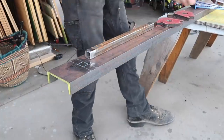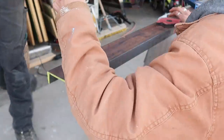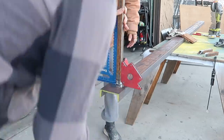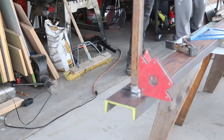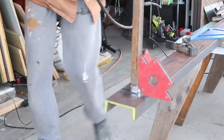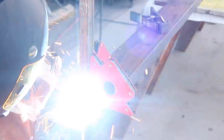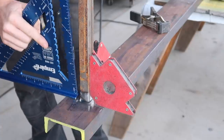With the angle grinder, I got a lot of comments about how people are also scared of it. And what I just want to say is pay attention to the sparks. I think that's the scariest thing, is you just need to pay attention to which way they are flowing and ensure you are moving your angle grinder away from you so the sparks aren't hitting you. I think that's the most intimidating thing, but you know, that's just me.